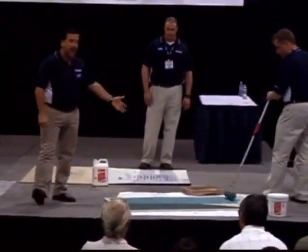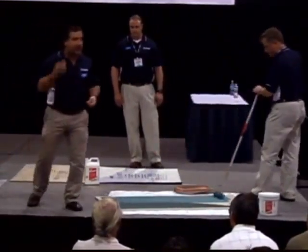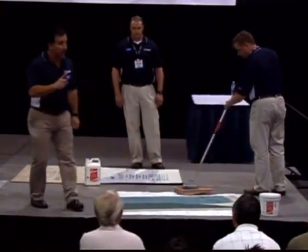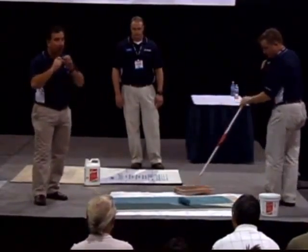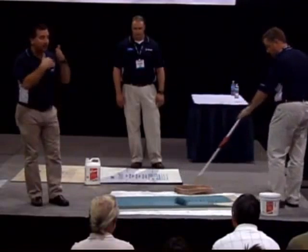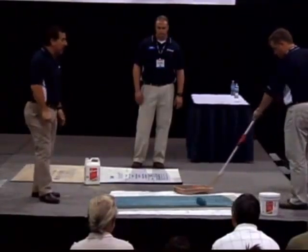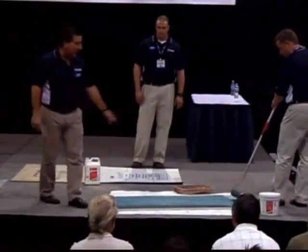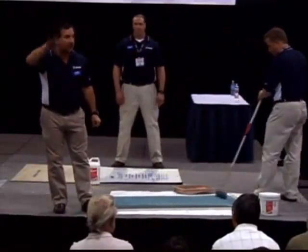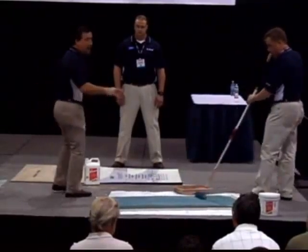This product rolls on with a 3/8-inch nap roller — you want about a credit card thickness. Make sure everything is coated. If you see backer board, concrete, or plywood through there, you're not waterproof. Water will find the pinhole, the spot where you're not covered. In the corners, brush them. It's not required to use a fabric, but if you have a gap to bridge, put fabric in there — it can only help. This does not allow you to do a lousy job with your backer boards; you still need to tape them and seal up all corners and seams. This goes over that, not in lieu of that. It's a roll-on waterproof membrane and crack isolation membrane.